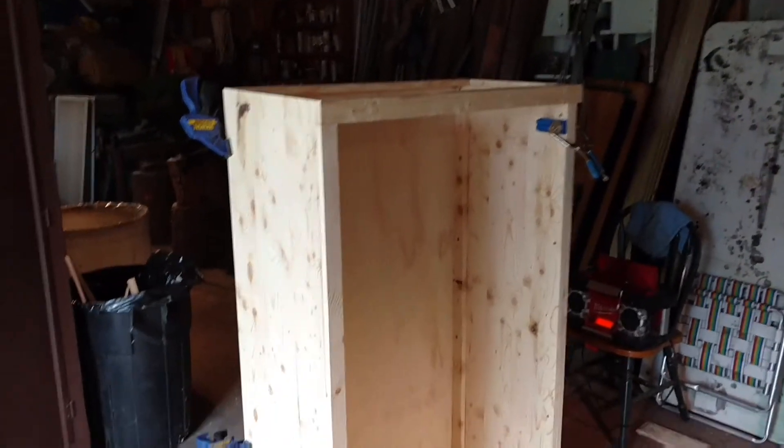Here I have the pieces I'm going to run across between my drawers. I took the pocket hole jig and drilled holes in each piece top and bottom so when I put it on there I just put the screws in — you'll never see any of the screws because the drawers will come up against the face. I measured down about 8 inches exactly, then a 2 inch piece for these boards, then another 8 inches, another 2, and another 8 and another 2. It's going to have 6 drawers total — six 8-inch drawers with 2 inch pieces of wood between each drawer.